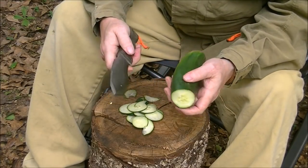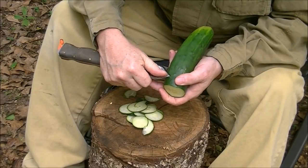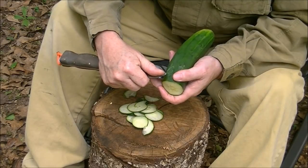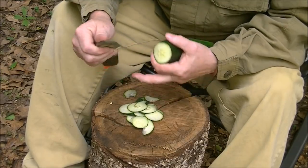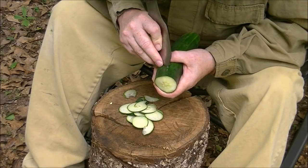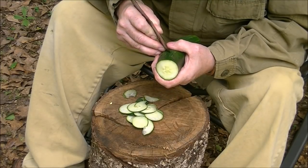The point does very precision work. You choke up on it like this, and this allows very precise cut work right at the edge. That way you can very finely feather and do fine detail. It's also small enough that you can turn it around and use it for pushing straight into the wood, making an outline to remove material and split it at a given angle exactly.